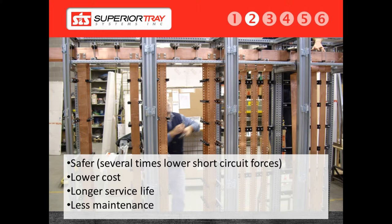Compared to a bus duct, the only maintenance that needs to be done on a cable bus is the cleaning of any leaves, tree branches, or debris off the cable bus yearly in the event that the cable bus is installed in a forest or a wooded area. As an example of the maintenance-free nature of a superior bus, we completed a project on a wind farm in Canada seven and a half years ago. Their first de-energization of the system was last week, in order to inspect their equipment and turbine systems. Cable bus is one of the reasons why they only have to perform this maintenance every eight years.